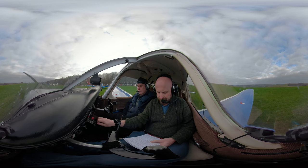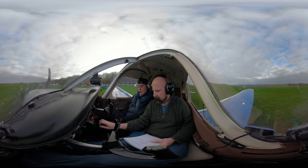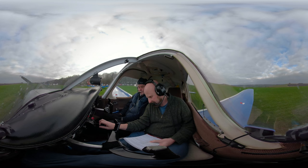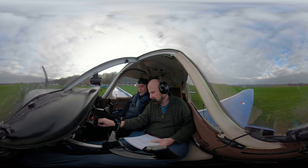RPM set to idle. When you come back off the top, bring it back slowly. Oh yeah, because there's 6 foot of metal spinning around on a shaft that big. Yeah, you're right. It's idle. 700 just over. Yeah, that's right. Yeah. All you're checking is the engine doesn't stop. Back to 12, that's it. And then before takeoffs.